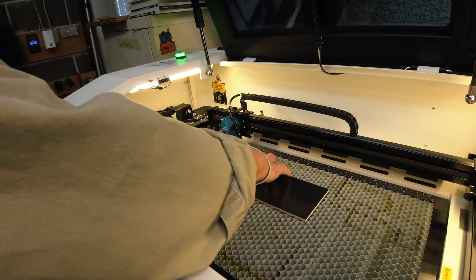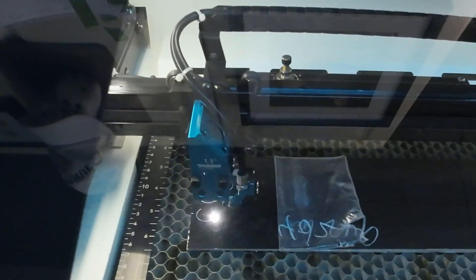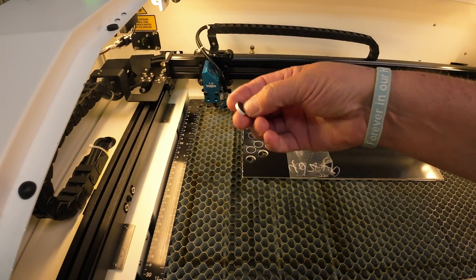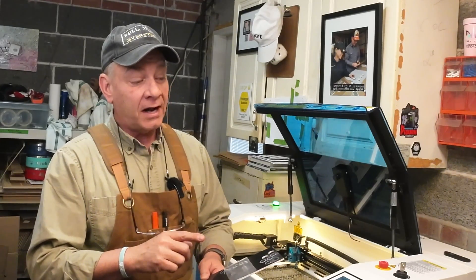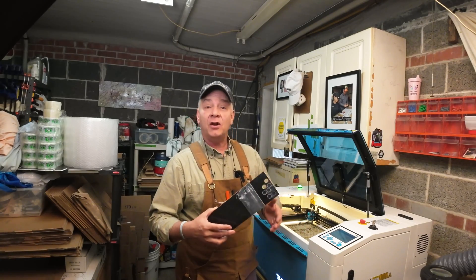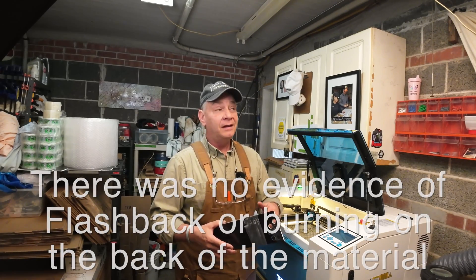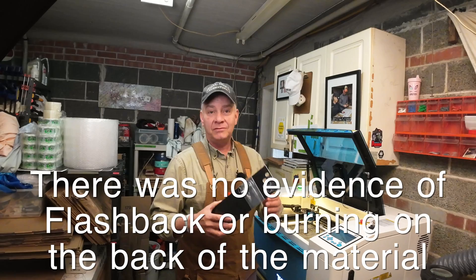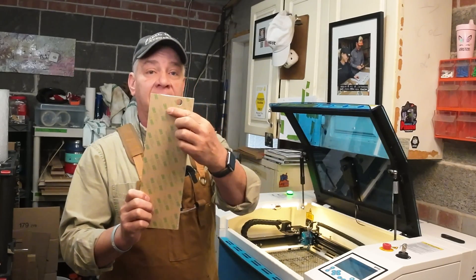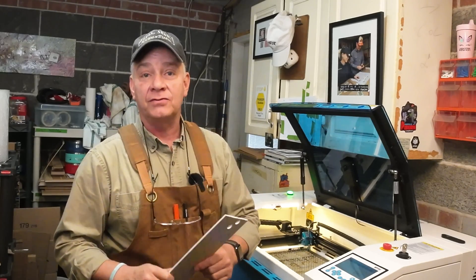Let's swap back to the 1.5 inch lens and see if it still goes through at the same settings. That's kind of interesting — I honestly thought the 1.5 was not going to make it. So at 10 millimeters per second and 90% power with air assist, both the 1.5 and the 2.5 are going to cut through your 1/8 inch Rowmark. I know at 15 mm/s it wasn't cutting on either one, and I could fine-tune at 12 or 13, but I'm okay with 10. For those of you who asked in the comments, those will be my cut settings for 1/8 inch Rowmark — it's a nice clean cut; the piece just falls right out.